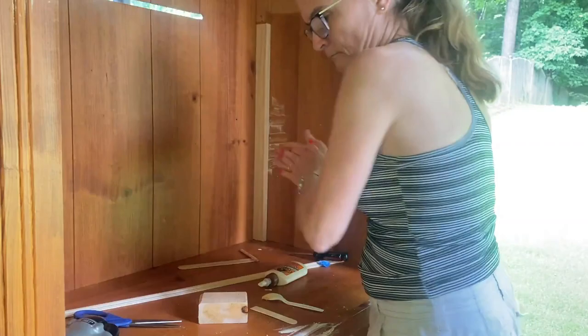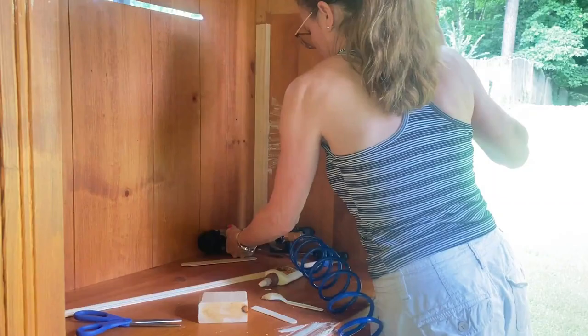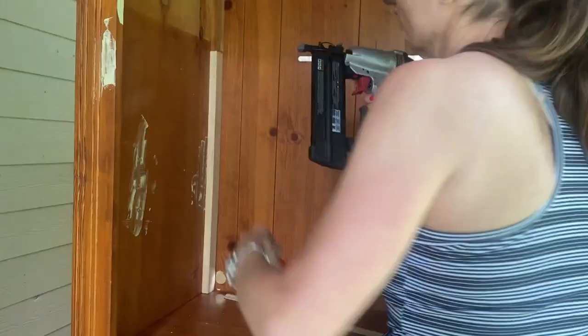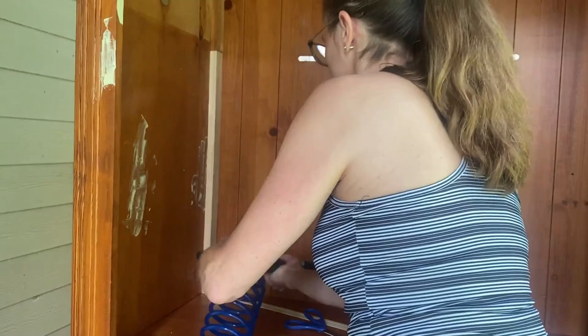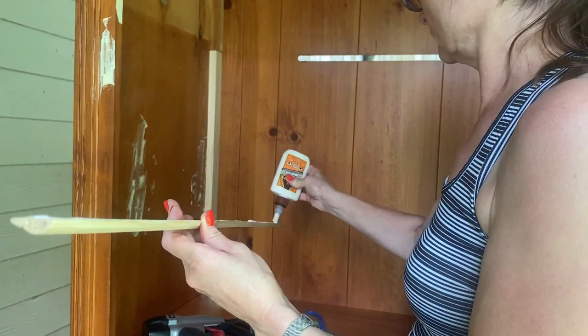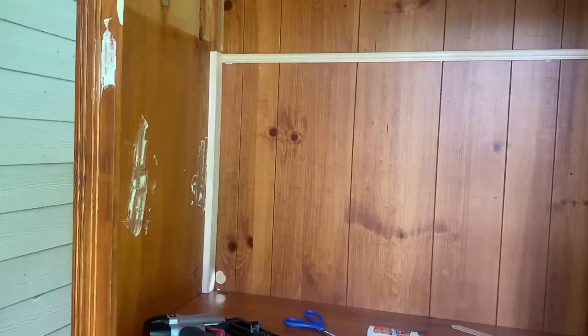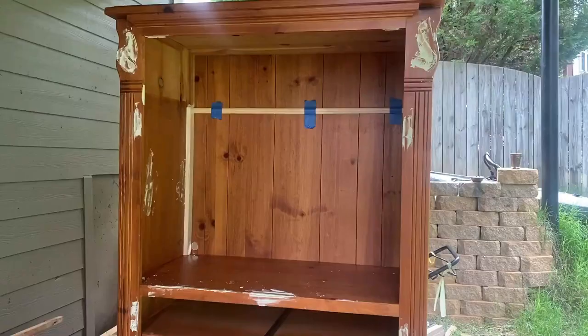I added the one by two on top of that shim and it was a nice snug fit. Where my wood piece meets what was left at the top of the furniture I also filled in with some Durham water putty so there wouldn't be a crack there. After I had glued that piece in place I used my brad nailer with a one-inch brad nail to staple it to the side. I did the same thing to the other side and didn't need to use a shim for that one. I also used putty on the inside of the cabinet to fill holes where you could adjust a shelf.